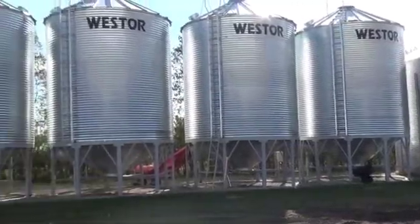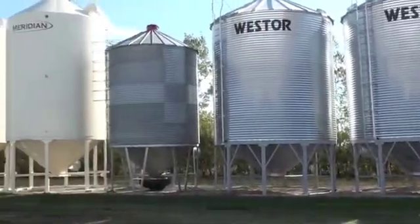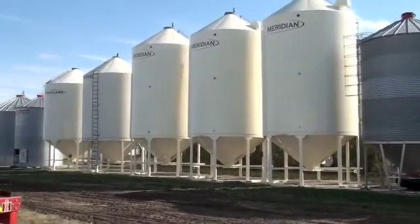The grower here mentioned a wide variety of temperatures — not so much moisture variation — but coming out of the field in mid-afternoon he was easily getting temperatures above 30 degrees in his stored grain. He made an effort to get grain into aeration bins where he could manage that high temperature and bring it down in a timely fashion. For bins that aren't full, growers can take out maybe a third or a quarter of the bin after it's sat for a bit, just to disrupt that convection cycle where moist air is brought up through the center of the bin and may collect right at the top. Removing that cone and breaking that cycle puts you at a real advantage.